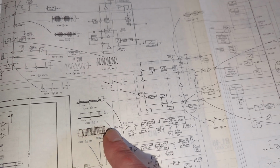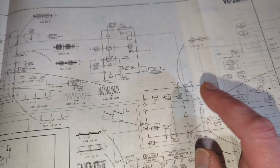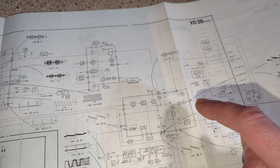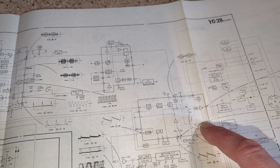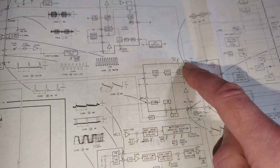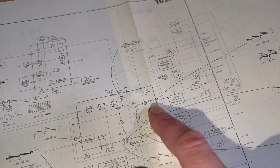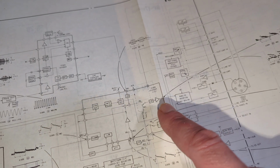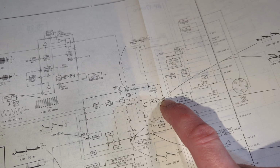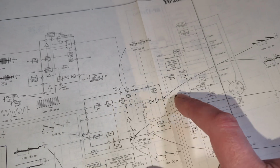So I've got video signal in, got chroma in, chroma up here, chroma out, and I have signal in here, which is part of YC-009. You can tell that from the waveforms, not from the block itself, it doesn't actually say on it. So yeah, got waveforms in. When I look at pin 35, pin 35 is the outputs and inputs to the whole processing section of YC-009, video processing. I've got nothing at all coming out, and when I record, it goes in. So that's good that it's going in, but I've got nothing coming out.